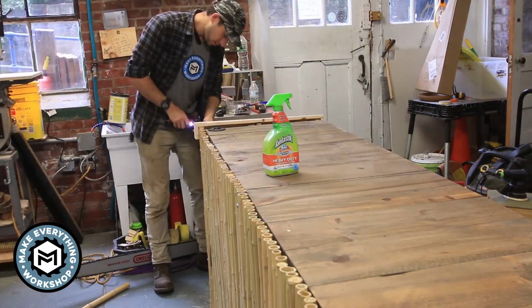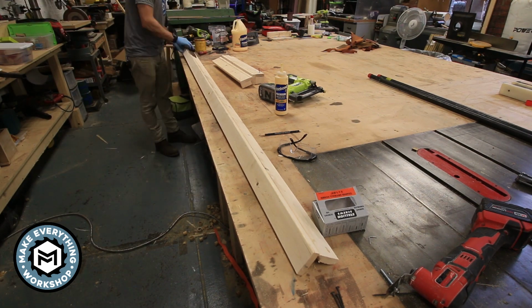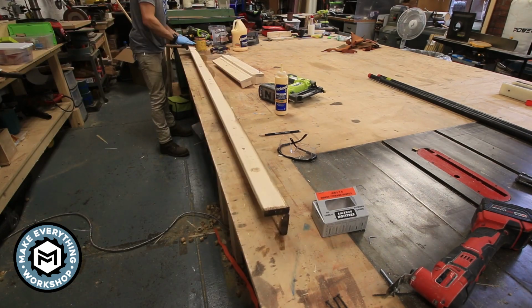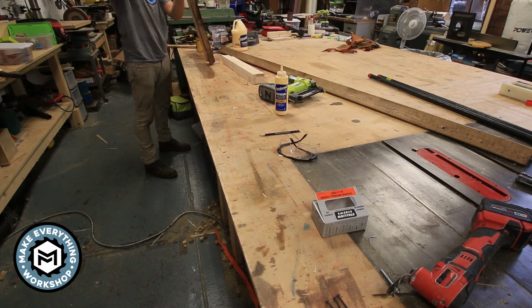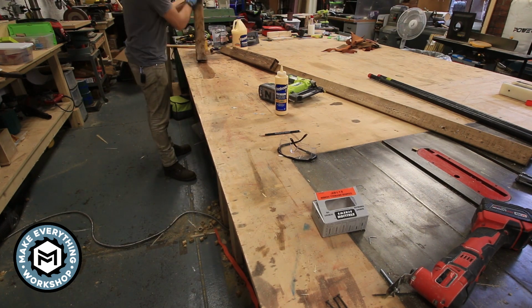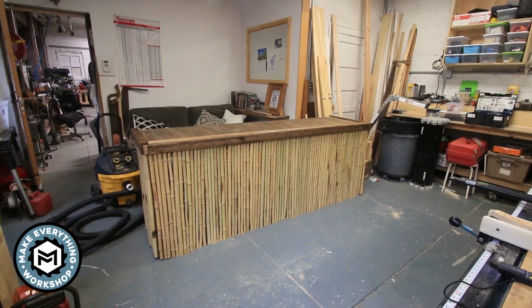And now I take the bar edge off and stain it up real quick. And like I said, it's the same special walnut stain, and I'm not doing any sort of pre-treat, just laying it on there. And it comes out surprisingly even. I've heard horror stories about people staining pine and having it be completely blotchy and only grabbing in half the material and totally looking terrible. To be honest, that's never happened to me, and I've stained a lot of pine.